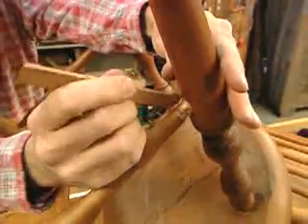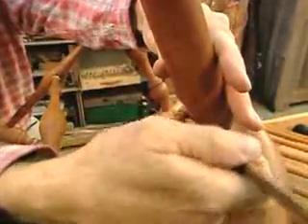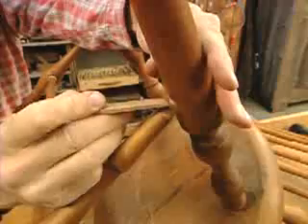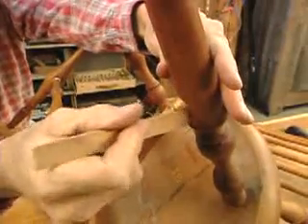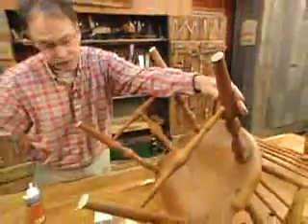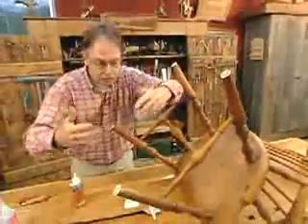What I do is use a piece of scrap wood — you don't need a ton of glue here. Work it out all the way around. Remember, less glue is more in this case. Then mist it with water, then draw it tight. Because the glue actually expands a little bit when it dries, you need to clamp it.